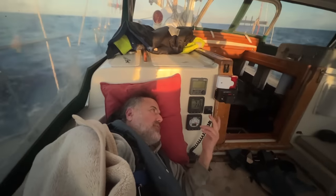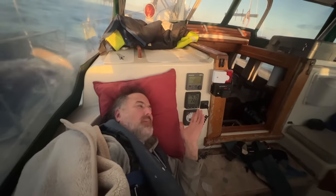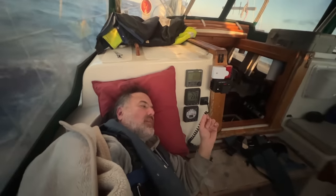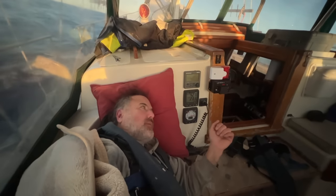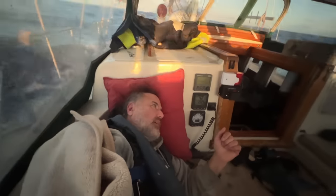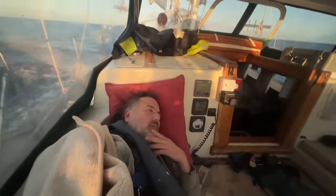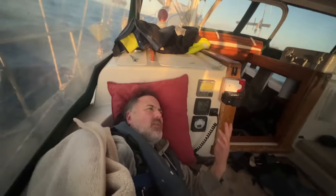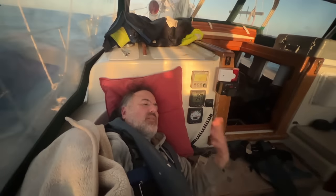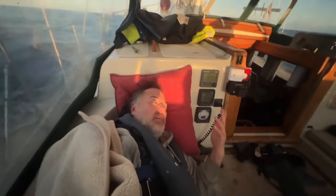One really big deal about this is that if something goes wrong — if I fall overboard, hit my head and go unconscious, or anything goes wrong and I can't hit that button — then within 30 seconds of the first alarm going off, the second alarm goes off and then everybody on the boat knows. Right now Mo is down below sound asleep, and if anything were to happen to me she would know pretty quickly because the second alarm would go off and she'd be able to come out and figure out what happened. So it brings a lot of peace of mind. Regardless of how many crew you have, if you have one person on watch and everybody else is sleeping, and anything goes wrong with that person and they can't hit the button, everybody finds out about it pretty soon — and that could feasibly make all the difference in the world.